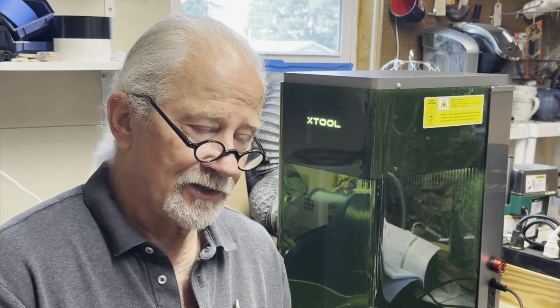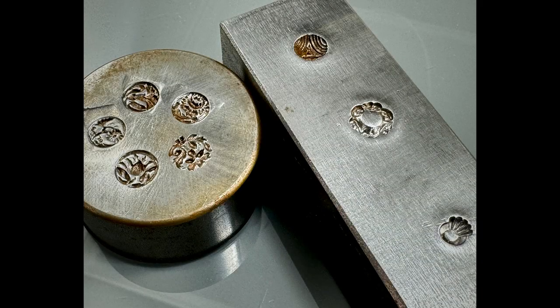You can make them yourself very easily by using something called a shot plate. Shot plates have been around for many centuries and they are really just a form of die — a die made out of a harder material that you push a softer material into to make something. I've got several that I've purchased. Here's an example of two that are commercially available, and there are many, many more that you can purchase.